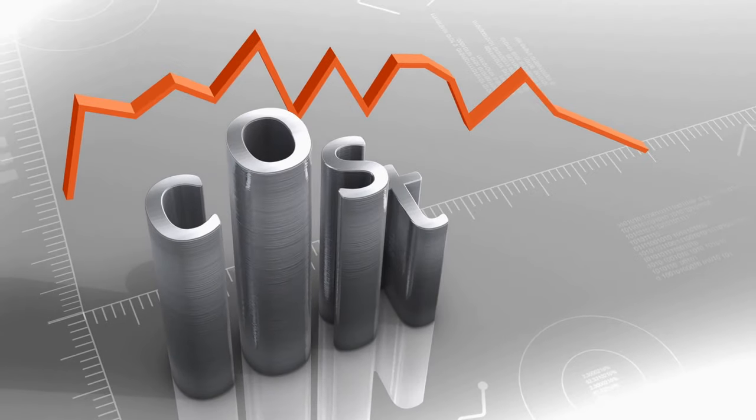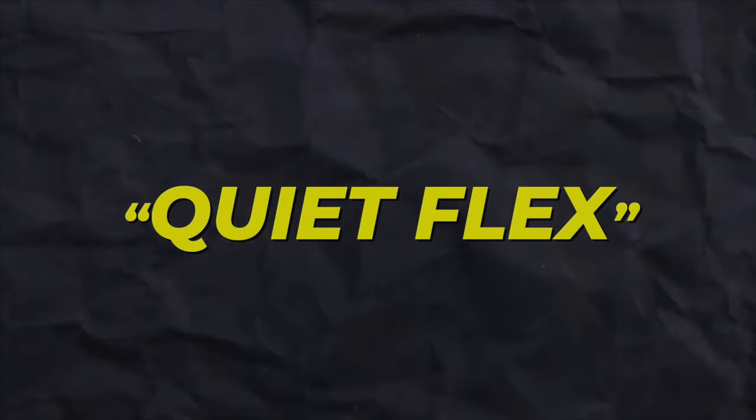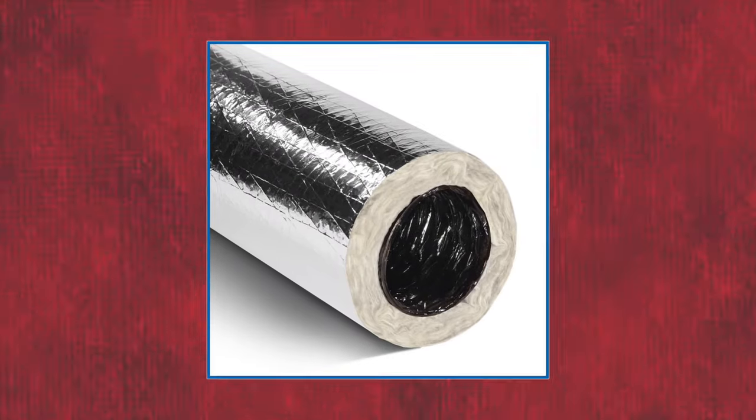Keep in mind this will still require ductwork, but you can typically run FlexDuct off of a supply box and return box, which can keep installation costs down and also increase comfort compared to hard pipe steel ductwork. Depending on which contractor you talk to, they may disagree, but I almost always prefer FlexDuct over hard pipe for one reason alone, and that is sound. As much as I'd like to think you'll one day admire the ductwork installed in your attic, in actuality you'll never see it — which is why I prefer FlexDuct, because it's quieter. They call it QuietFlex for a reason, and since noise is the number one comfort complaint we get from customers, we will always prefer to put in FlexDuct when possible.